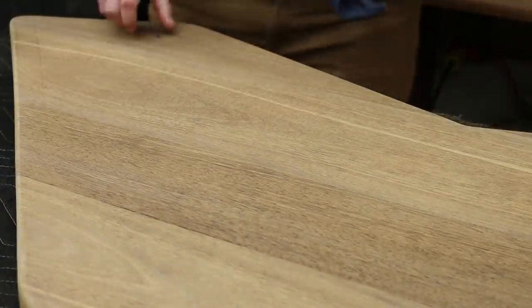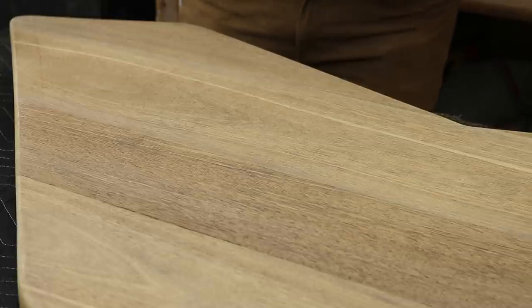There are some little cracks in there from when it was glued up. It looks like there was a reddish filler in there at one point that kind of came out, so I might just dig that out. I'm going to wet that wood a little bit, just to see what that natural wood color looks like and see if I have a filler that might match that. We'll go from there. Now what I'm doing is just wetting the wood here with a little bit of naphtha.